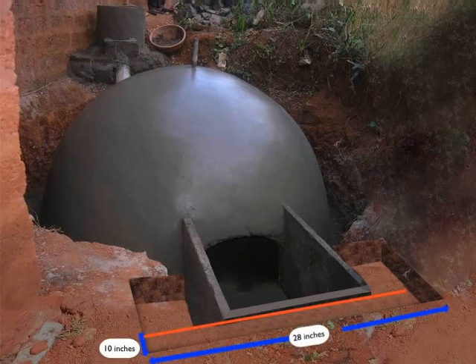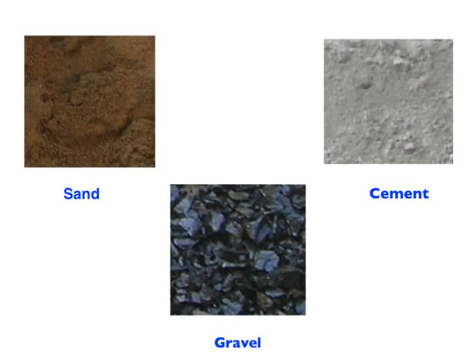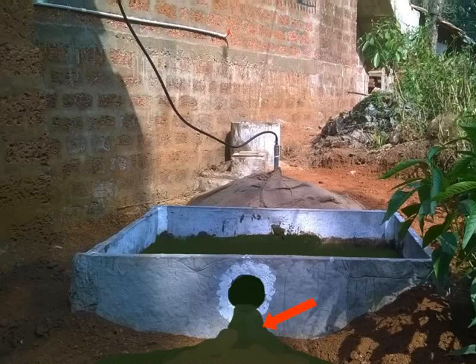Lay foundation on both the adjacent sides and the front side of the lower tank using gravel, cement and sand mixture. The gravel, sand and cement is mixed in the same proportion as mentioned previously. Now join the four walls of the upper slurry tank. Plaster the edges of the walls with cement. The wall with the hole should face the fields. This will help the slurry to flow out smoothly through the hole.